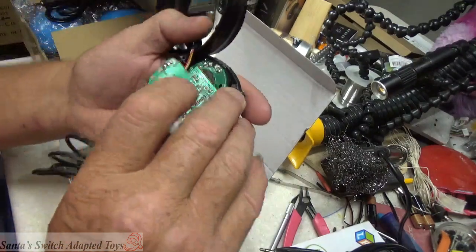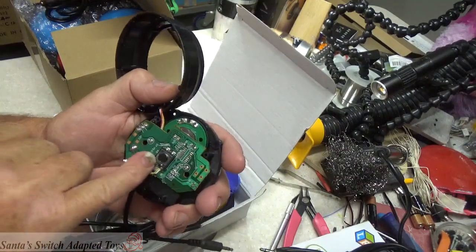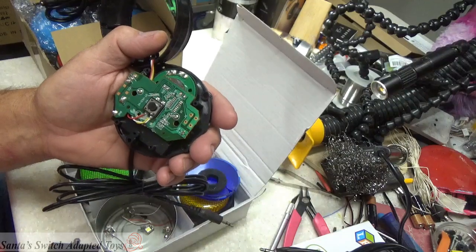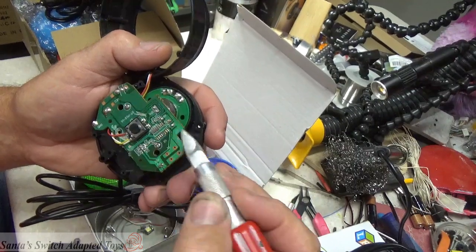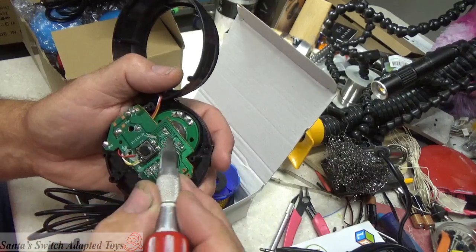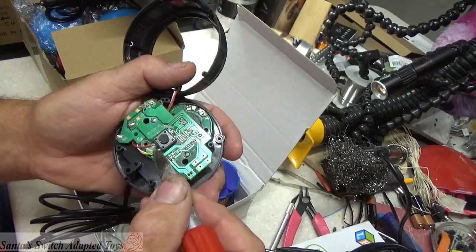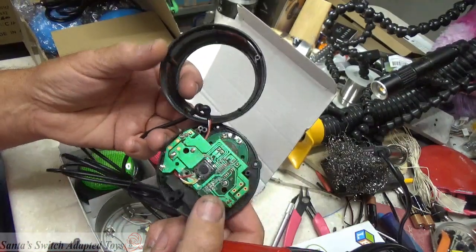It requires scratching, again, you want to isolate this part of the switch right here. That's all you need, and you don't want any interference from anything around it. The chip was sitting across here. I removed it. I scratched the circuit board to make sure that there was no contact anywhere. Scratched it here, again no contacts, and also over here, and soldered to just this side of the switch to put our cable on.